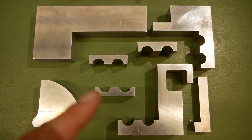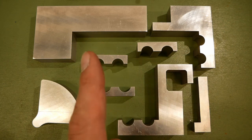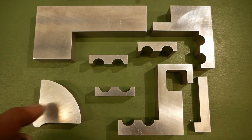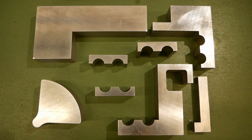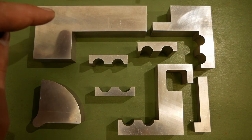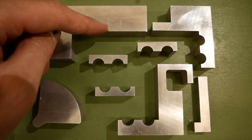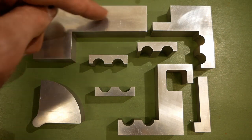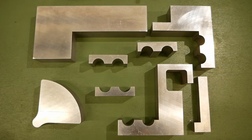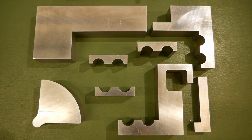So these are all the parts that I could machine on the MK1 wire EDM machine. Now of course these parts still need finishing — most of them need a few holes, which is a bit boring to show. Except for this part, which needs to be machined on two faces and I need to ream some holes for the rods for the z-axis. So I'll do some video material on that.